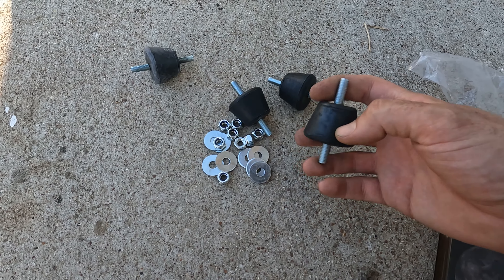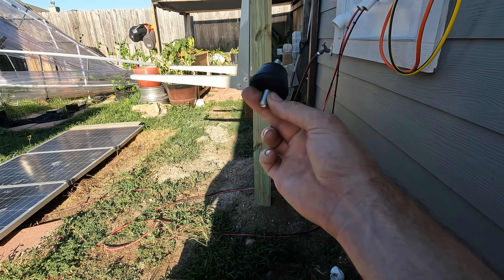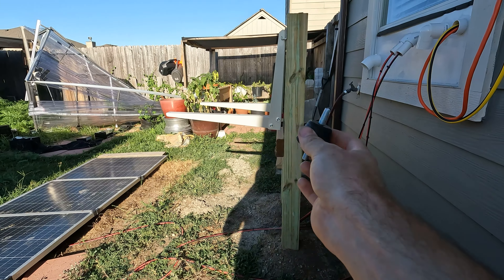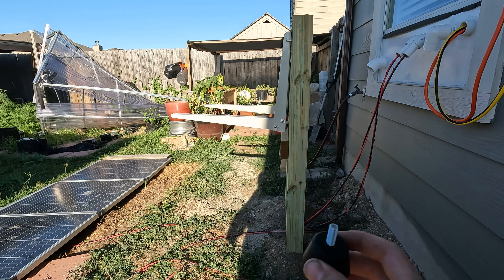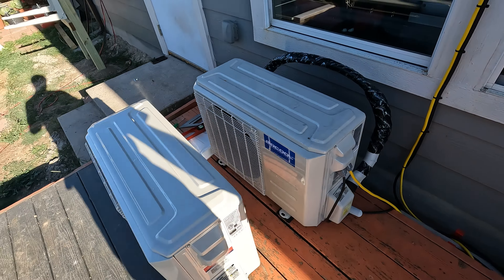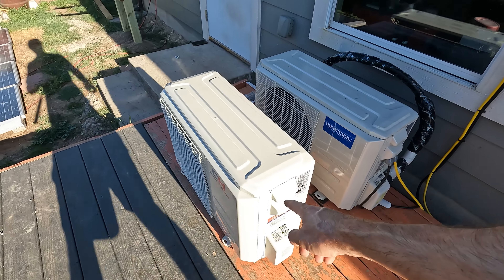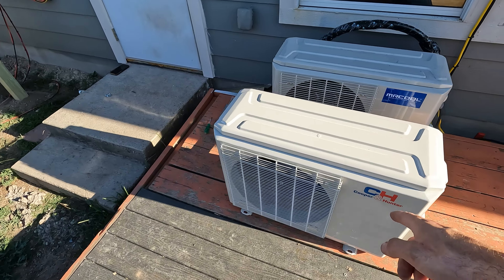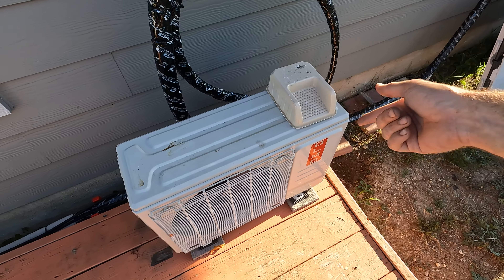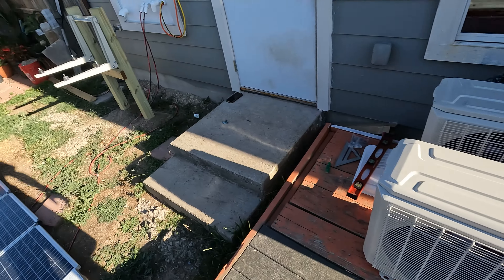Here are the feet that came with the wall mount. I'm going to throw these on loosely — they're going to sit like this with a nut and a washer at the bottom, then we set the unit on top. This thing looks literally just like the Mr. Cool unit — pretty close to near identical. But the weird part is this is supposedly 9,000 BTUs but it's also supposed to be 25 SEER, so that may have something to do with the condenser size. Now I'm going to get this big heavy thing lugged up on this.